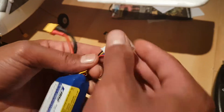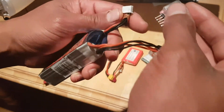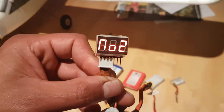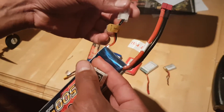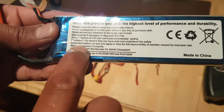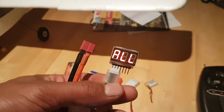Plugging in the three-cell battery: three cells, total voltage 12.5, individual cells 4.16, 4.20, and 4.18. Testing another three-cell: total voltage 12.6, cells at 4.17, 4.20, and 4.18 — gives you the voltage of each cell in the pack. For a two-cell storage battery, the back label says to store long-term at 3.8 volts per cell. That's where this gadget comes in: plug it in, reads two cells, 7.63 volts total, 3.81 and 3.82 — perfect storage voltage.